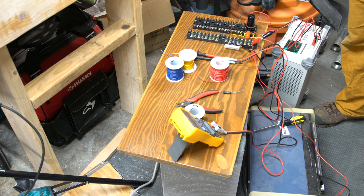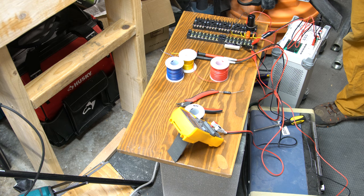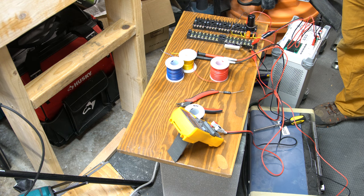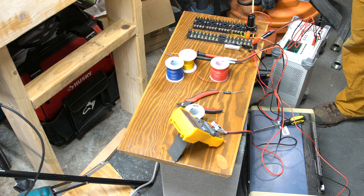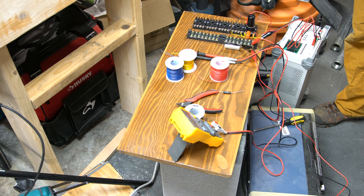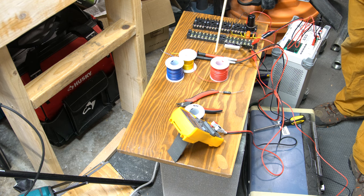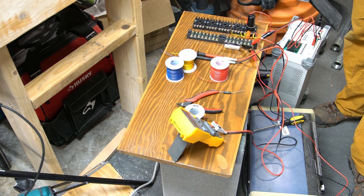You can always go for the design center ratings, make sure it looks good, and tweak a little afterward. After you finish the amp you might say it sounds good and clean but want to push it a little harder, so you adjust as you go. Mostly you're trying to get it working in the range you want, not clipping too much in the power section, and not drawing too much current. The next step is to finish this prototype and regularly prototype all these different tube types. I'll also be setting up the preamp section separately from the power section.